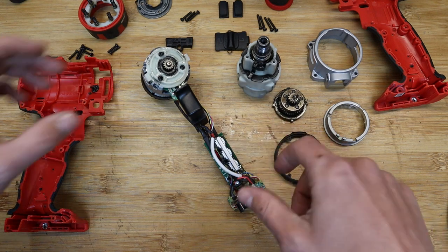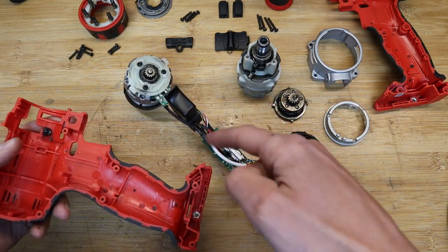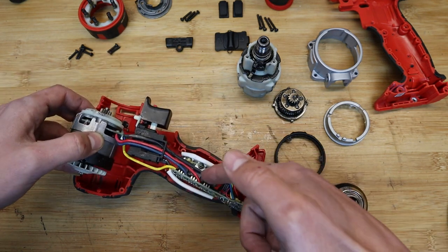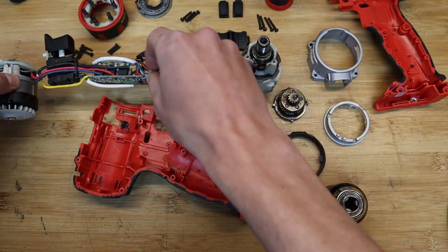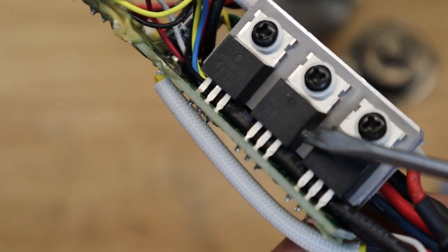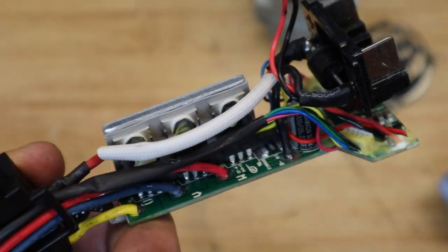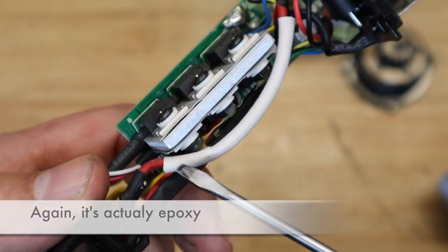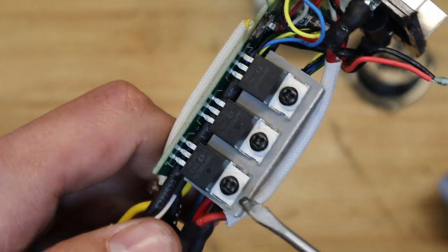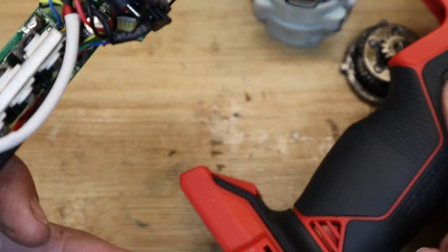The board is all exposed, which raises a question over its lifetime with the small ventilation holes providing airflow to the heat sink — but they're quite low and far from the heat sink itself. There are six MOSFETs controlling the drill speed — three on each side — bolted through and hot-glued to an aluminium heat sink that floats just above the board. The question is where does it actually heat sink to, since the clam encases it with only tiny holes for ventilation.